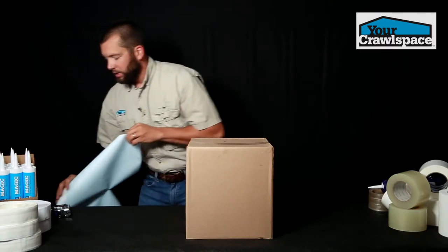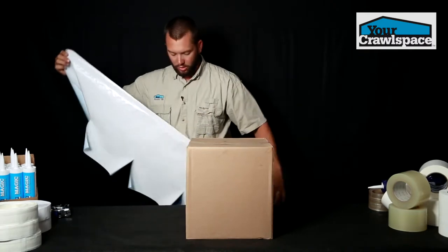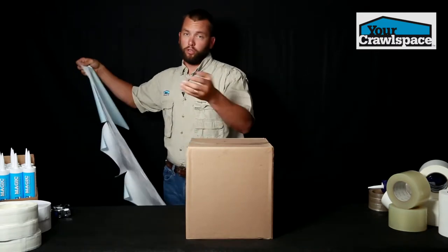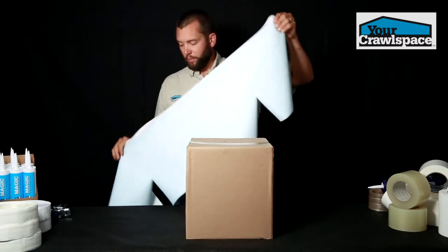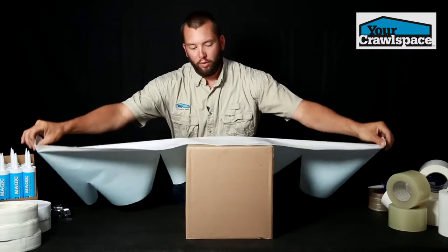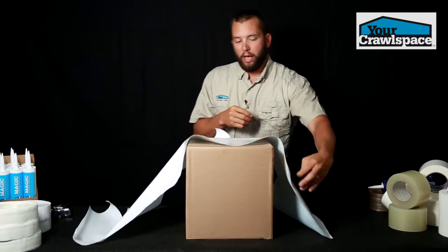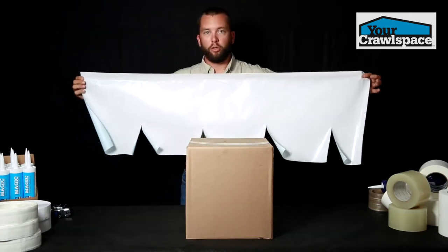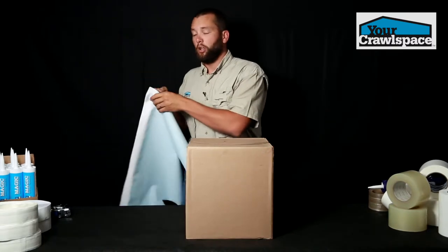What I've done here is I've gone ahead and cut a section of wall curtain — this is a two-foot section, cut to size for this mock pier, which is a 12 by 12 by 12 box. What we're going to do is measure and take the lineal footage of the pier, roll out the appropriate amount of liner outside of the crawl space, make our cuts on our corners, and we'll end up with what we call a pier skirt. Whether you've got five piers in the crawl space or 25, we're going to cut all of them outside.